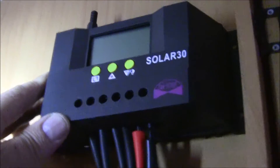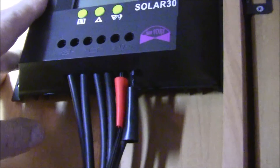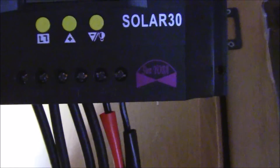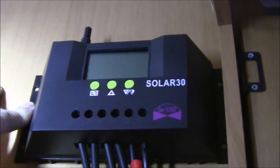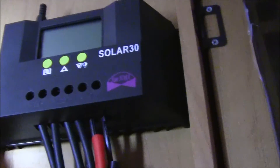I've re-stripped the two main ones because they were a bit short — all the rest fitted fine. The screws are substantial and go in very well. You've got to wind them down so that they are open at first, because they're all wound in. Then you put the wires in and away you go. Make sure you get them round the right way — wherever you take them out, make sure they go back in the same way, or you'll have problems. I'm going to pop that on in a minute, put the batteries back on, and see what we get. Shouldn't get much from the solar panel because it's getting a bit dusk now.